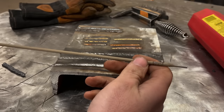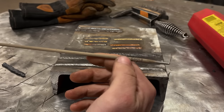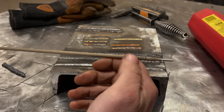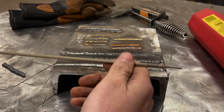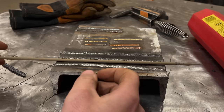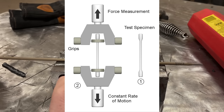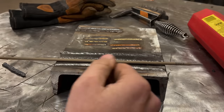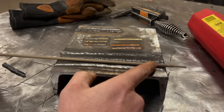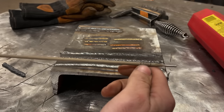I'm going to do a dedicated video on every common stick rod, but I will mention that the numbers on a rod refer to simple things. Some rods have an 'E' in front meaning electrode. The first two numbers — in the case of 6013 that's '60' — refer to tensile strength: 60 means 60,000 PSI tensile strength. A 7018 rod has a higher tensile strength than a 60-series rod.